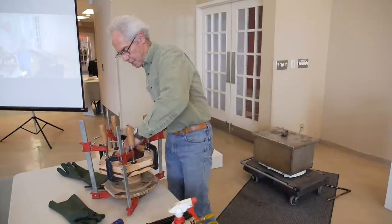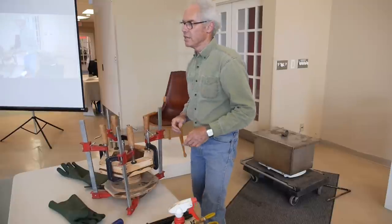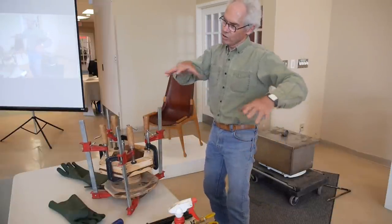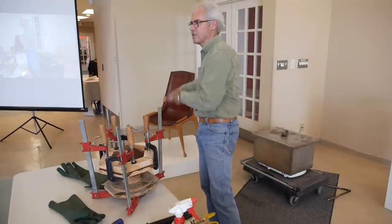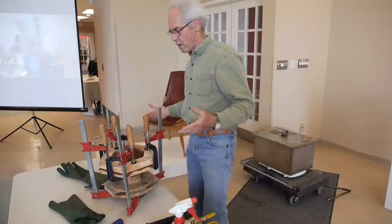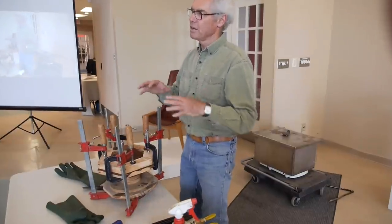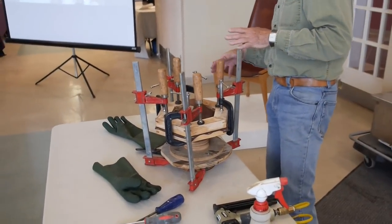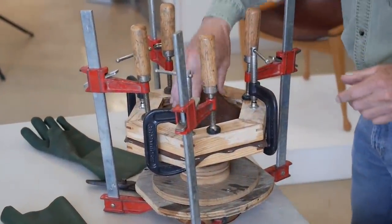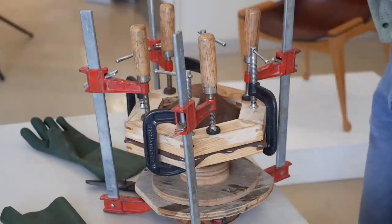It's a very interesting place. The hide is in the pits for a year, and they take it through varying vats with increasing strengths of bark, mainly oak bark, and then they'll do a sumac finish on it, and that takes another 3 months. So it's fairly expensive, but not radically. Once you have the process established, you just keep pulling out the same amount.